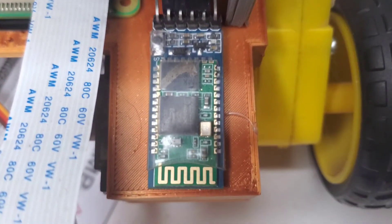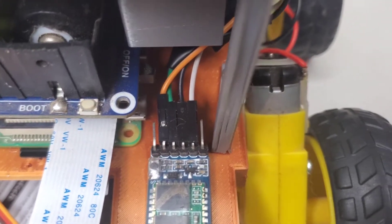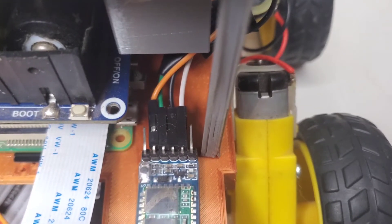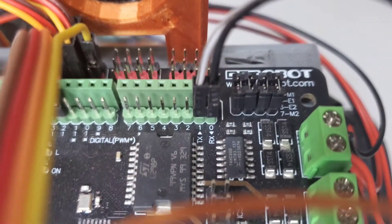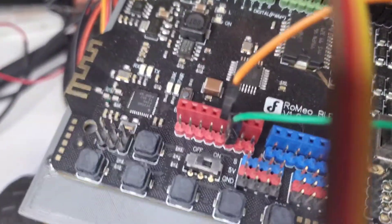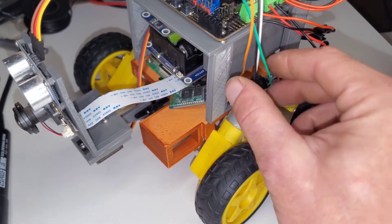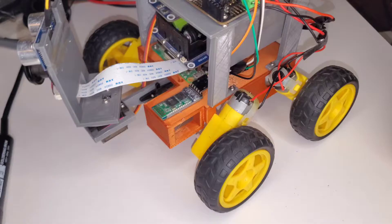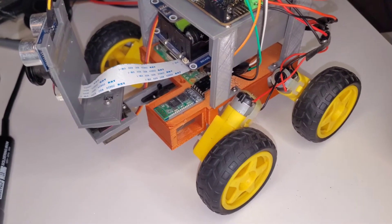This is how you're going to connect the Bluetooth chip. The black and the white are the signal wires. The white one is the one that has the voltage divider on it — on this Romeo board, that goes to pin 1. The black one goes to pin 0. And then 5-volt and ground you can figure out. Wrap it around through there, then take some hot glue and glue it down. Make sure you hold it while it's drying so it stays secure. And now your robot's brain can communicate with its central nervous system.